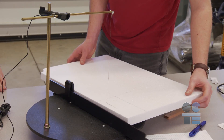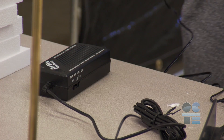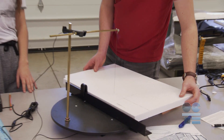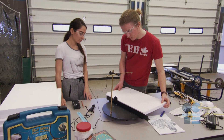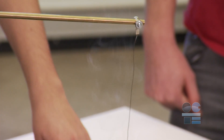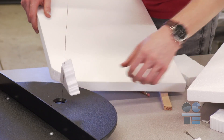Tabletop versions are usually powered by an AC wall socket supply, while handheld versions are sometimes AC powered and sometimes DC powered by batteries. The cutting of expanded polystyrene by means of a wire heated to about 300–400 degrees Celsius is hazardous for a couple reasons: fumes are emitted that can be toxic, and touching the wire can seriously burn exposed skin.